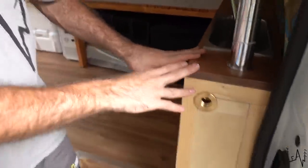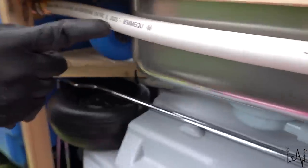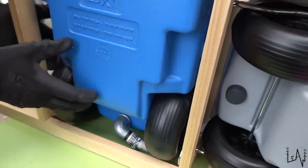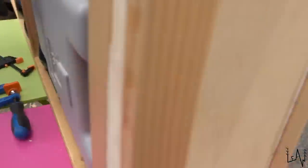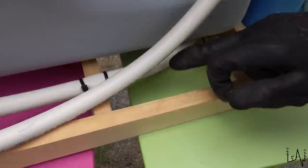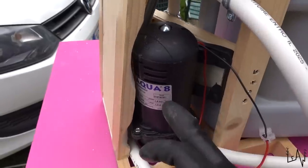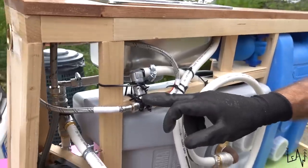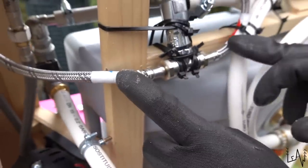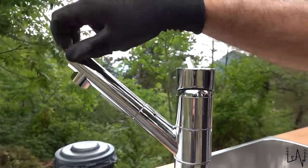Many of you asked how we built the hydraulic system — we have some images for you. The fresh water comes in here from a hose inside this pipe and it fills up our fresh water tank. From the fresh water tank, this pipe goes all the way back to the water pump. In front of the water pump there is a filter, and from the water pump the water goes up to the expansion tank. The water comes here where it splits to fresh and hot.